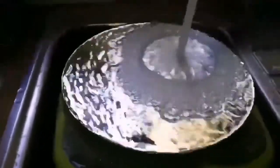So the mirror is clean, it didn't take more than 10 minutes, so it's ready now. I'm just rinsing it with the tap water, then after that I will use the deionized water. For removing the small droplets when I'm drying it, of course, I will use the tissue: you bend the tip of the tissue and make a sharp point, then drop by drop, you absorb them into the tissue.